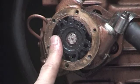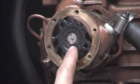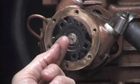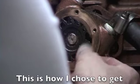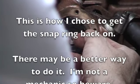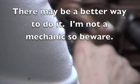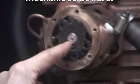Finally got the snap ring in. To get the snap ring in, what I had to do was actually pull the shaft out a little bit and sneak the impeller on very carefully so I didn't push the shaft back. Otherwise everything was flush and I couldn't get the snap ring on. So you have to bring it out just a teeny bit — not too much — and then ease the impeller on very gently, and then you can get the snap ring in the groove.